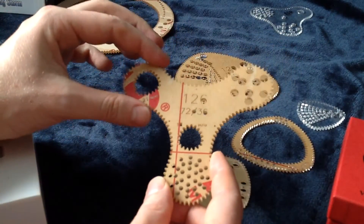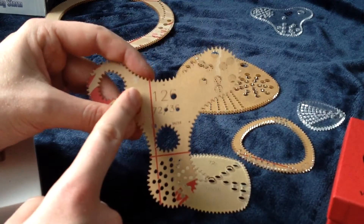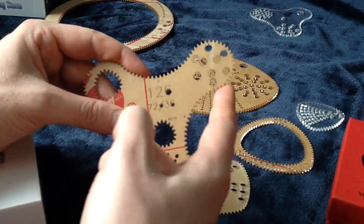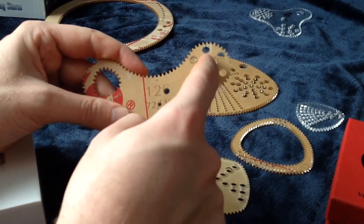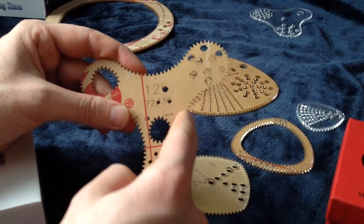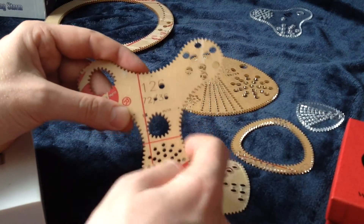There are some really strange lobed pieces or dog bones, depending on whether they've got three or four lobes. As you can see, this one says 126, 72 over 36. Just look at it and see — there's a big circle piece and there's a little circle piece. The radius here is smaller, so this part is made of 36 teeth if it were a whole circle, and these parts are made of 72. So if you try and put anything bigger than a 72 gear through here, it'll get stuck.